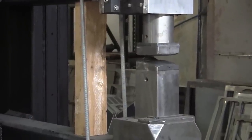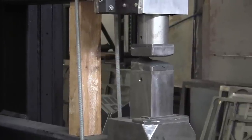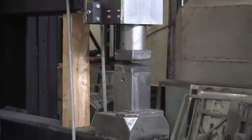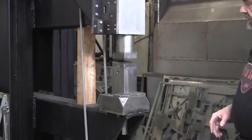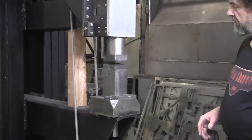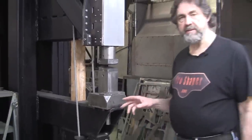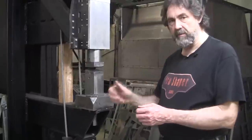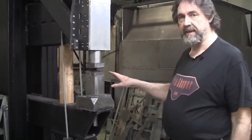So there's the motion that's done with a VFD. Got unbelievable control with the machine. And as you speed it up, that point where you hear the noise hitting, that's when the die is being thrown and will shrink the metal. So we're not going to be using this tonight either.